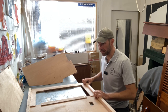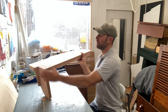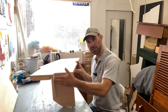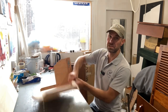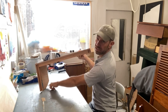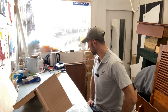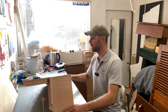I've also got the base part here — the toilet will sit on there, and it's going to get covered in cladding plastic as will the front. This piece here isn't getting cladding so I'm going to flow coat it white — it's barely going to be seen but it needs to look tidy. This is the door recess where the sliding door goes in, so that gets flow coated too, and the same underneath, so it all looks tidy. The only bit I'm resisting flow coating is a small area where I'm going to be glassing in that piece into the hull just to make sure it's firmly attached. I'm going to mix up some gel coat, get that done, get some lunch, and then come back and start covering it all in the plastic cladding.